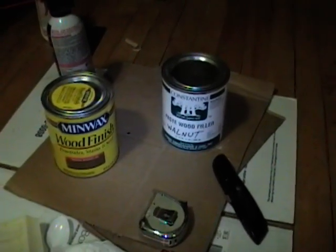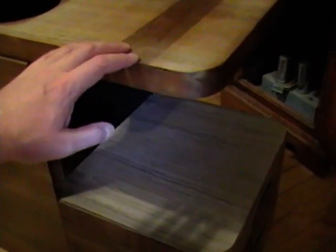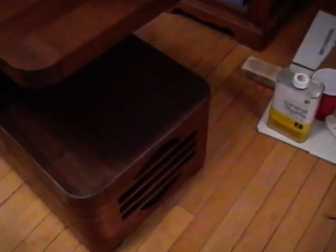The whole cabinet is now stripped and repaired, so I'm going to move on to some special walnut stain and then grain filler. After the stain and grain filler I'll most likely go over it with some toner. Originally this was probably all done with toner, but using just a spray can it's a little tough to coat something this large, so I like to use stain first and then use toner as needed. For example, after the grain filling and stain, this edge and the bottom need to be much darker, so I'll be taping off the cabinet and spraying with dark walnut toner. Here it is after staining — not bad, not quite as brown as I'd like it though, so I'll give it a light dusting of toner lacquer after the grain filling.